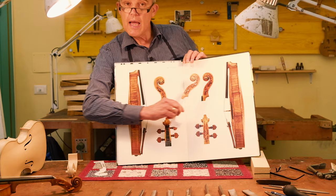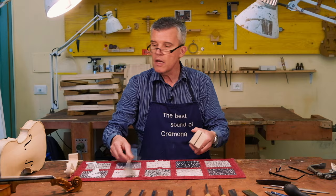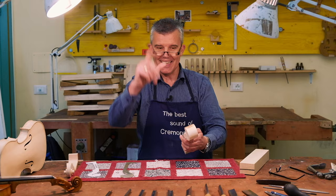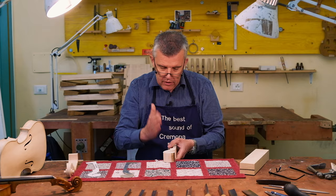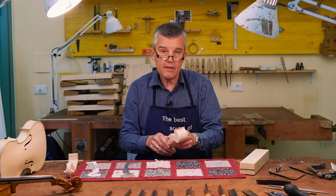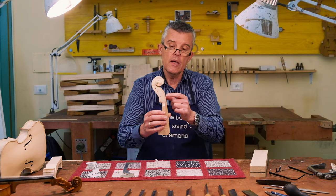These are the pictures from this world. You create this model, and with this model you can then make this instrument. You put it on the wood, you cut it out. In real life it goes much, much slower. This here is the Ole Bull — ciao Wendy, I'm working already. This is the Wendy square, which I cut out. From this, with the book and the gouge and the chisel and everything, I clean it up, make it nice, start cutting away — first the peg box, first scroll, second scroll, things like this. And so slowly, slowly, I achieve something a little bit like this.